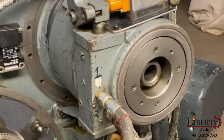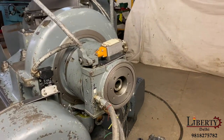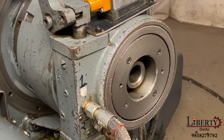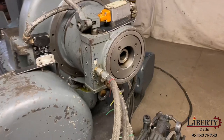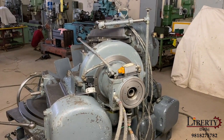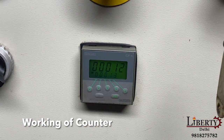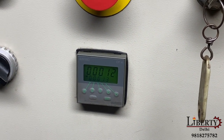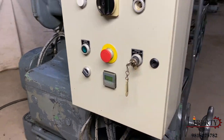The indexing rotation can be seen as it comes back. This is the hydraulic tool clamping. The hydraulic cylinder can be seen unclamping — the cylinder moves fully forward, then clamps back. This demonstrates the working of the hydraulic job clamping. We have set 13 teeth in the counter; already 12 teeth have been cut. When the counter reaches 13, the machine will stop automatically — auto stopping. As the counter hits 13, the machine has now stopped.